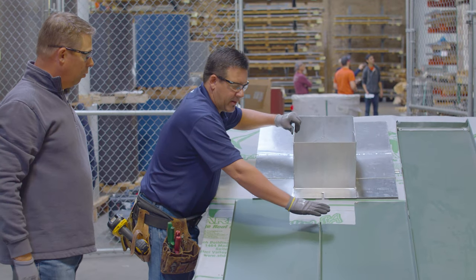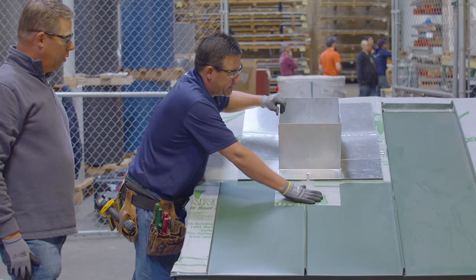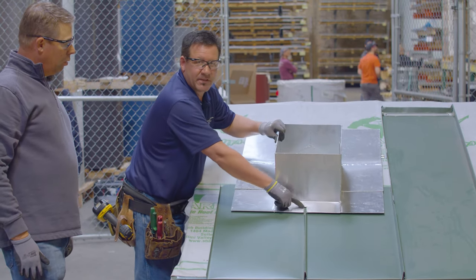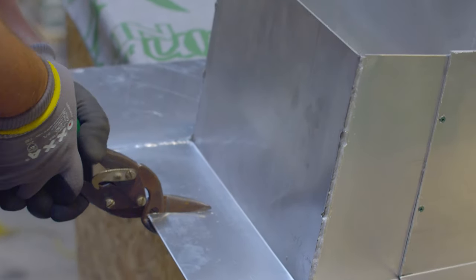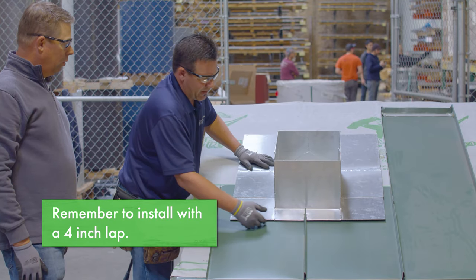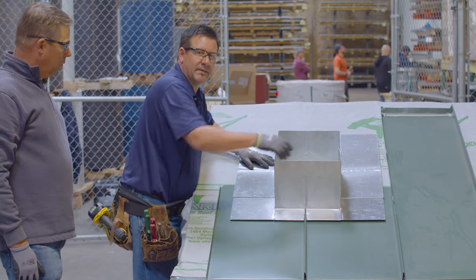This represents the curb and our rib layout with the square penetration. We've lined that up, measured it out, and notched the bottom flange to account for the rib, which will give us the overlap to the penetration panel overlap. Now we'll pull this part, put butyl tape underneath it, and then we'll work on the sides.